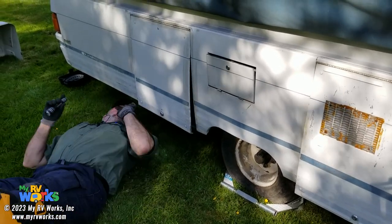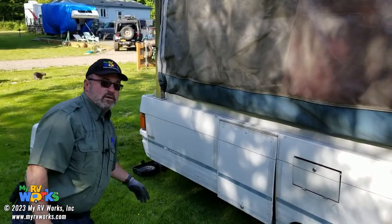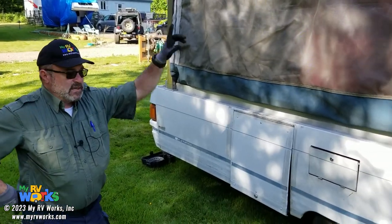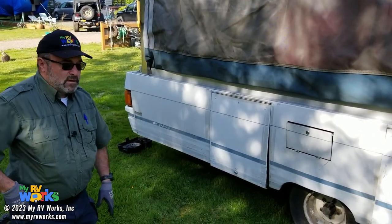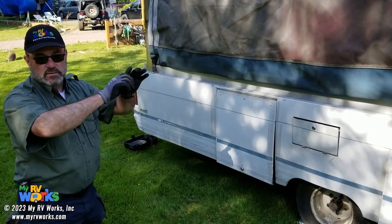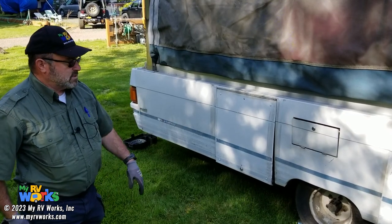All right, so when they took the water heater out, they did a good job. They took the fitting, made a new flare, made a 90 degree, and it comes up and feeds the stove. So they capped it off properly. So it's not like we could just tap into it down there. A lot of times when people take a refrigerator out, the hose is still sticking there with the cap on it. But this one, they did it right. So we'll be checking the LP at the stove.